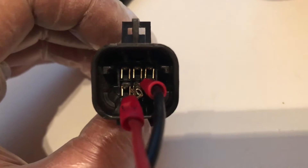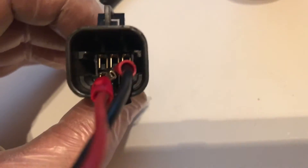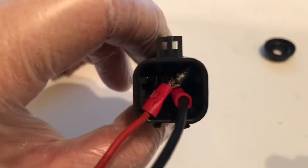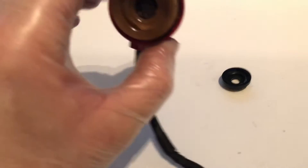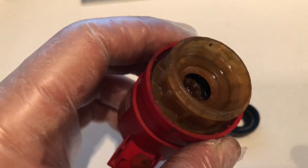There are six pins on the connector, and you've got positive and negative. You can switch the positive and negative around using the two lower pins, which are the blue and the red pins — the bottom two on the right side in the middle when looking from this position. Switching them around will reverse the effect, changing the spin direction either clockwise or anti-clockwise.